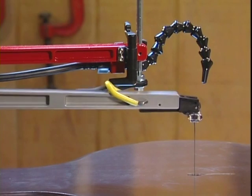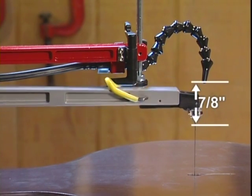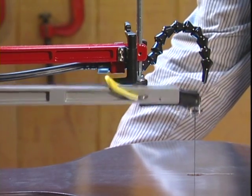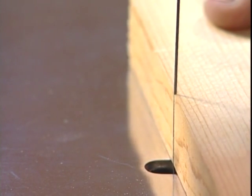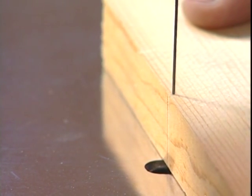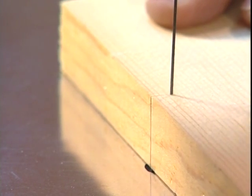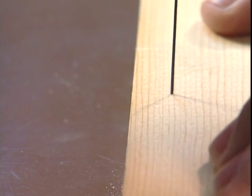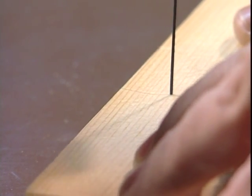Watch this — that's a 7/8 of an inch movement in the blade. A traditional scroll saw would provide about 5/32 of an inch movement. The long stroking action allows you to move faster through your material and keeps the saw from sawing its own sawdust. The longer stroke keeps the blade from overheating and breaking, so blades last longer on a Hawk Precision Scroll Saw.